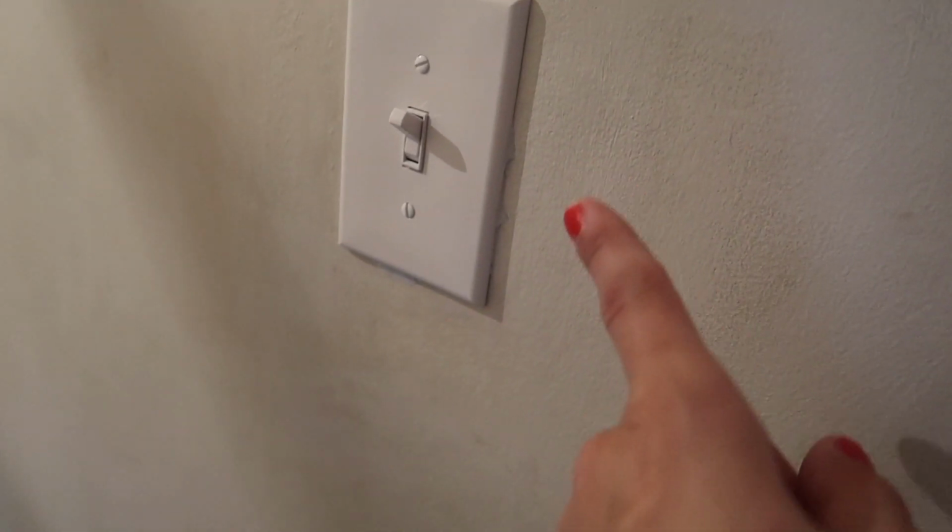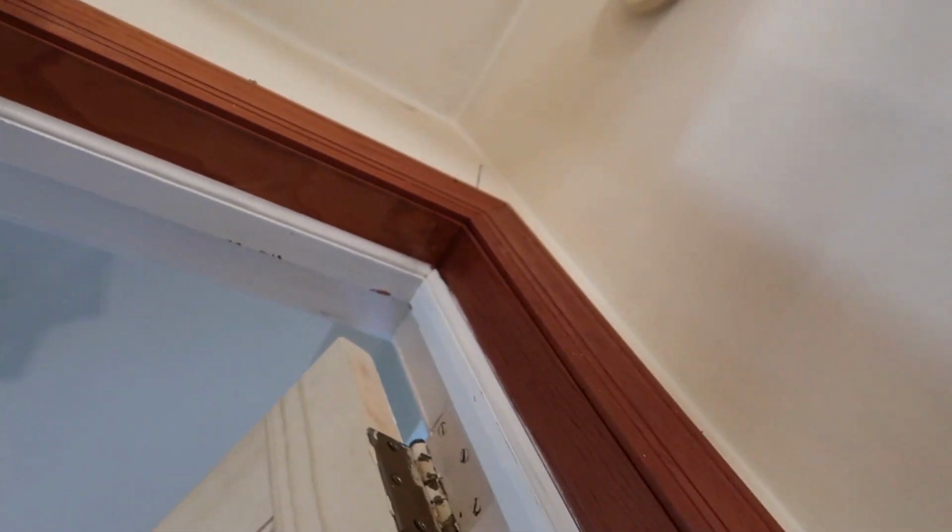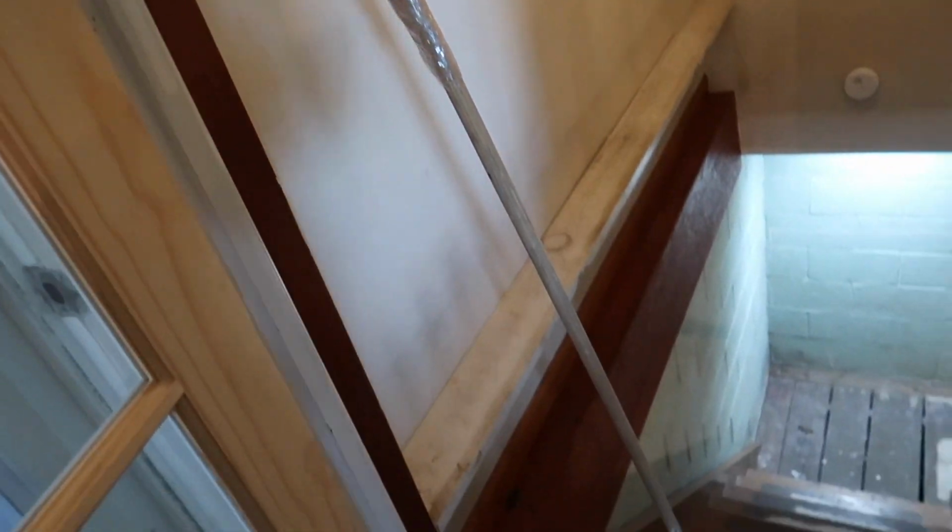And then I went ahead and filled some nail holes, like from the fire extinguisher. There was a little bit of torn drywall around the light switch, so I put a little spackle there, and I'll sand that down. And then there's just some nails up there, and there, and one over here, so I'll take those out and fill those holes also. All right, well, here goes nothing.